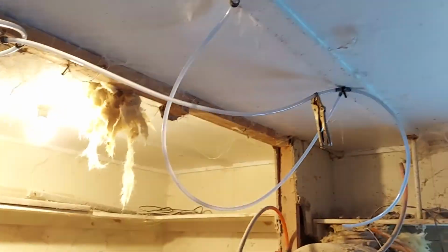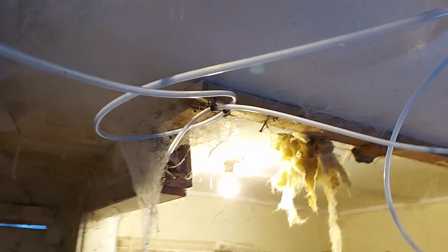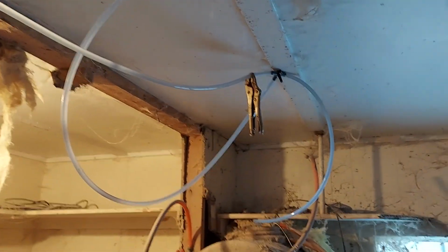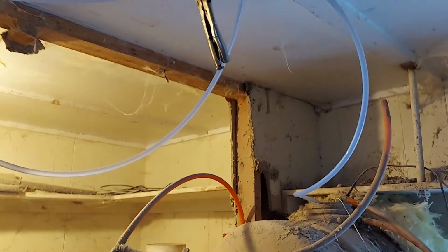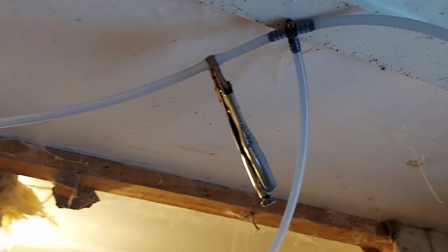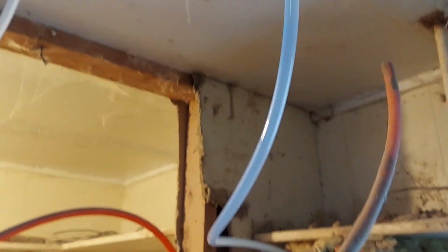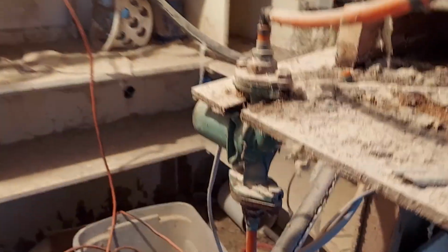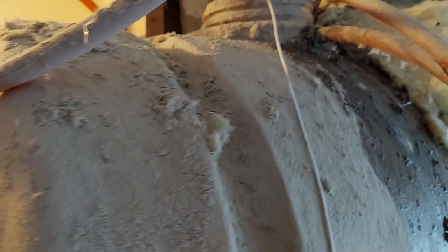where I had to get a little bit creative. I haven't had a chance to change the plumbing around. This is all new last week. It comes in through that black plastic, and it's a mess in here because of the chickens, of course. Loops around. I ran extra because I wasn't sure where I was going. I ran a T right there, but I couldn't get it to flow equally. I was getting too much out there and nothing in here, because this is for the chickens, and that little Taco circulator keeps it circulating for the chickens.